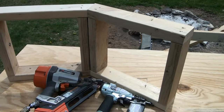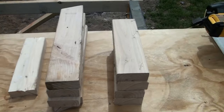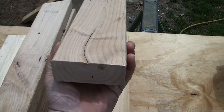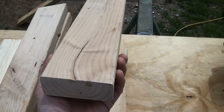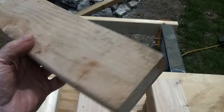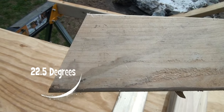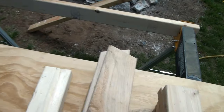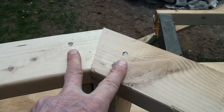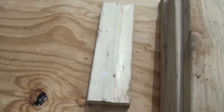To build this little mock-up, right over here are the pieces that I pre-cut so that we can build it together. I've got four studs — my wall is only going to be 16 inches tall, so I just have four short studs. Your wall is going to be 8 to 9 feet tall depending on what you have in your home. I've got my top and bottom plates with the angle cut on the end, and that angle is 22 and a half degrees. Back over to our model — 22 and a half plus 22 and a half, when you put them together, make the 45 degree angle. And then we've got the special blocking right here.